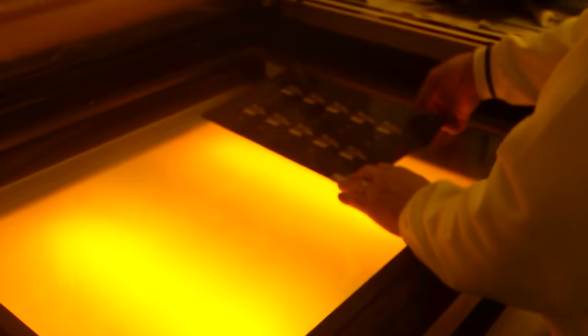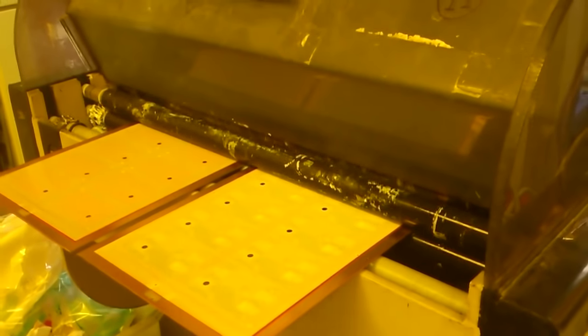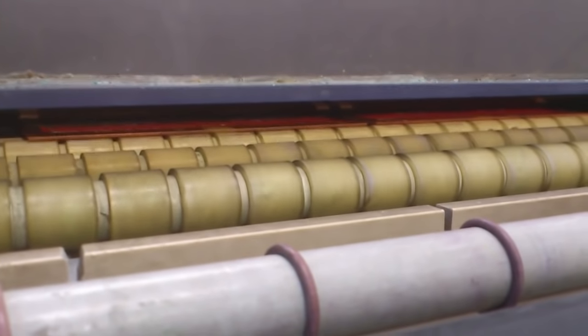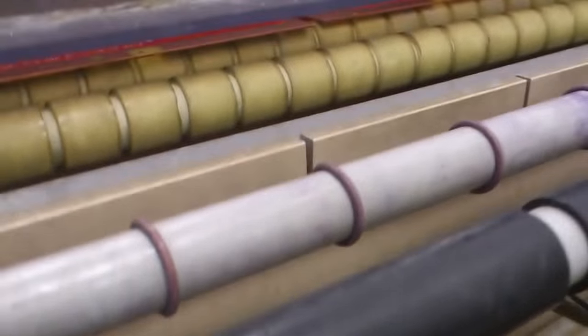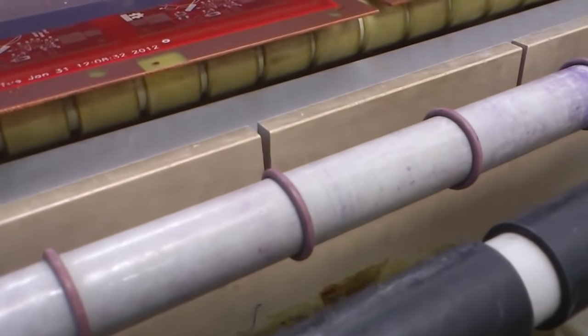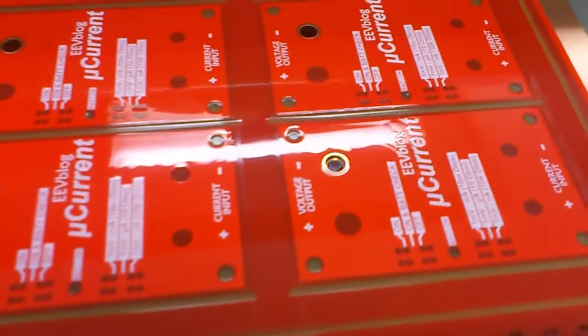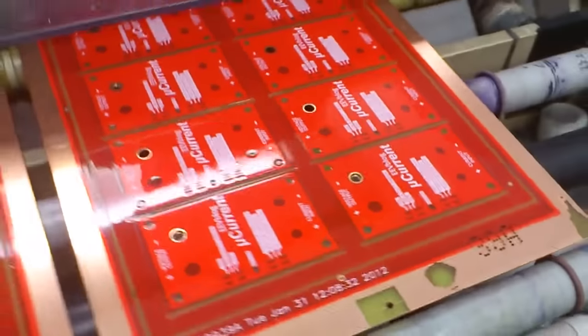We apply our film for the top and bottom component or silkscreen overlay, and they need to align those accurately. You can actually do the component overlay as an inkjet printing process, which is common on low cost prototype boards, but it's not nearly as good quality or as accurate as a photo-imageable process. So if you want really high quality silkscreen with a lot of detail and accurate alignment, you definitely want a photo-imageable overlay process like that used here. We expose that to UV light — getting a bit sick of exposing all these different layers — and then we develop it. You can see inside the developer machine the jets spraying developer, then water to clean them out, ready for the next process. Here it is: the beautiful photo-imageable solder mask — developed, exposed, fantastic, super accurate, much better than the inkjet process.